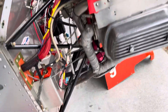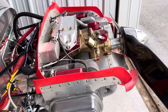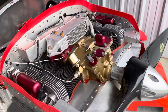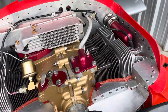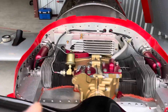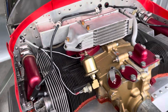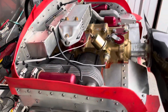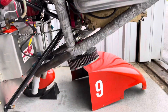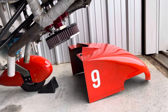AeroV engines and all Volkswagen engines are known to have some cooling issues, especially with the cylinder heads at high angles of attack. Part of it has to do with the way the air flows as it comes through the engine. It should come through your cowling and drop down in between the fins to cool the cylinder heads, and then it comes out the bottom via some sort of a chute in your cowling — you can kind of see the opening in the cowling there in the background.